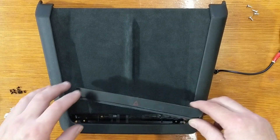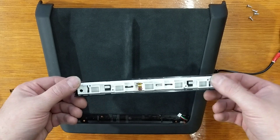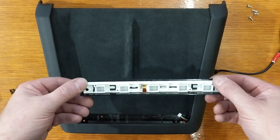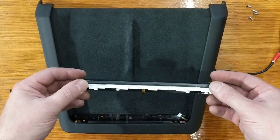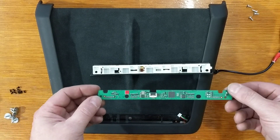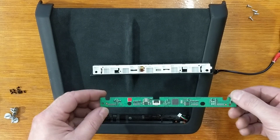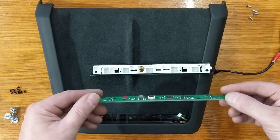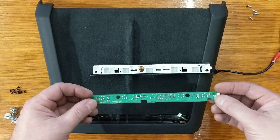I've already taken this one apart. There's a panel here with a bezel for the lights and the LEDs, and then a flat flex with the capacitive sensors on it. That goes to a little board here with a 48 MHz ARM Cortex M0 made by Cypress that's doing the capacitive sensing and talking on the CAN bus.